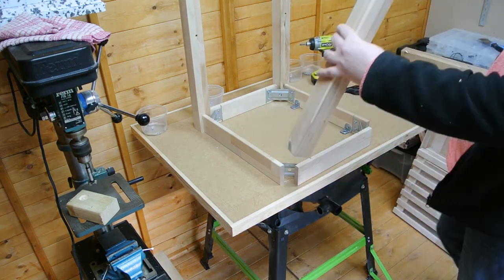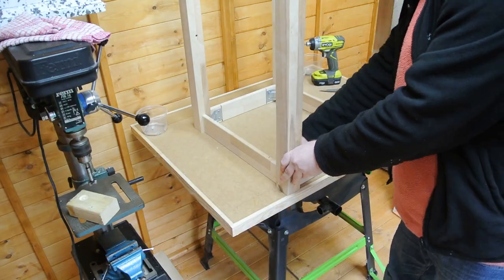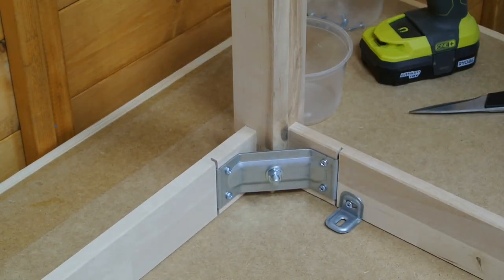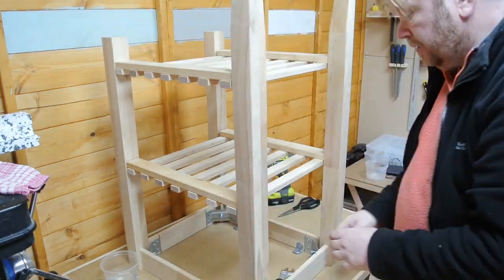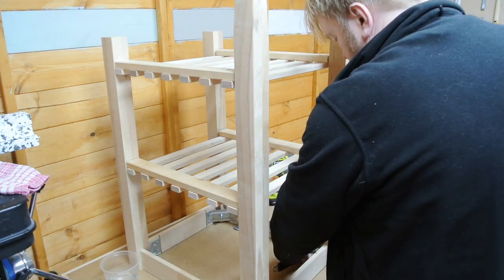And to be honest, if you try to design the same kitchen island from scratch, you may well be using the same hardware from the likes of Axminster or Rockler — that's to say, metal L brackets to secure the top, and metal bolted corner fixings that make a really strong apron rail to leg joint.